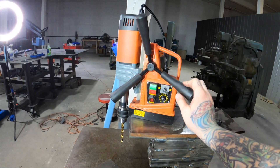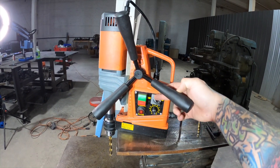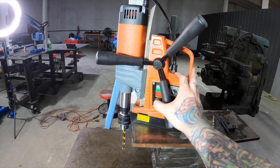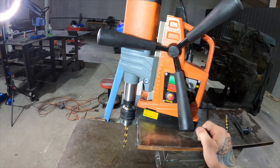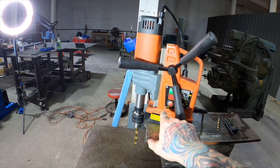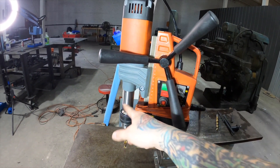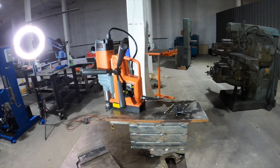One of the other things I liked about this one is the variable speed — you can adjust it up and down and it goes forward and reverse, so those are pretty good options. And there's this switch here that magnetizes it; when you turn it on, that's how you start it. But if you were to demagnetize it, even though it's still on, it's a safety feature and it turns the drill off. I do like that feature a lot.